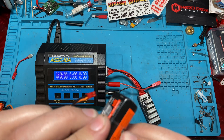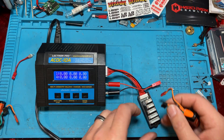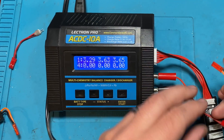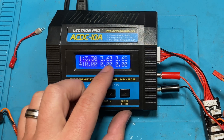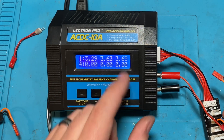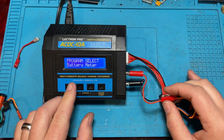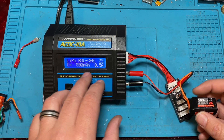There's actually some damage right there, but I think we're okay. One cell is much lower than the other cells, but not so low that I think it damaged the cell. Here I'll plug it in — you can see it's 3.30 versus 3.56 and 3.65. When we try to charge it, we get a delta V out-of-balance error.